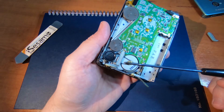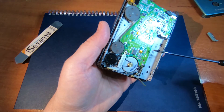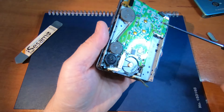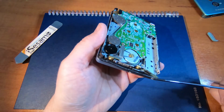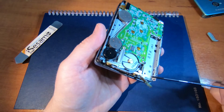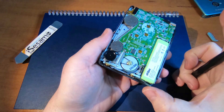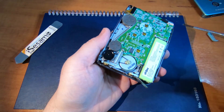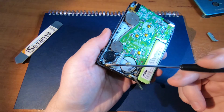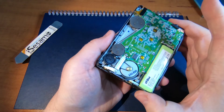This negative terminal goes onto the ground plane of the circuit, and I can see all of that ground plane comes back to the negative terminal here — so there's no extra circuitry between the external terminal and the battery terminal, no fuses or anything. It's the same for the positive. This door here makes contact with the battery at the positive end, and that is the same piece of metal as the positive terminal. So I can't see a reason why the external terminals work but the battery terminals don't. Let me push a battery in and press play.